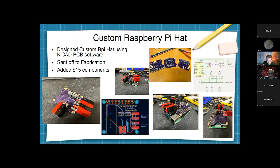And there's some artwork Steve did for me. I put that on the back. And these are the printed circuit boards I got. You can only buy a minimum of 3. Over here you can see I've stacked 4 sets for DC distribution. Freddie, I'm sorry, there's no circuit protection between these. They're all just wired together. And I've got 2 MOSFETs here, and the MOSFETs chop up the 13 volts DC into a PWM, pulse width modulated signal for the dew heaters. And there's a little support chip right there for those.